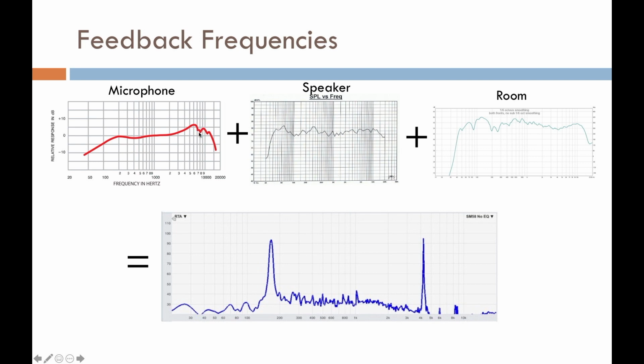So this microphone might actually trigger high frequency feedback partials before it triggers mid-frequency feedback partials. But that's not the only frequency response in the chain. We also have to worry about the frequency response of the mixer, which should be pretty flat. But then, importantly, the frequency response of the loudspeaker. That is very rarely flat. Once again, there's usually a roll off in the low end, and a roll off in the high end, and some sort of bumpy roller coaster along the way.